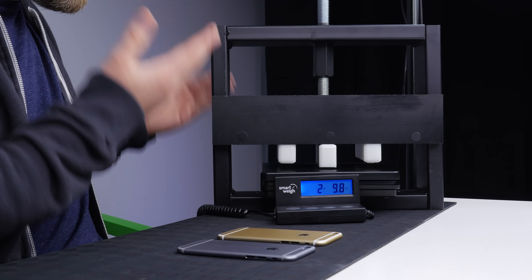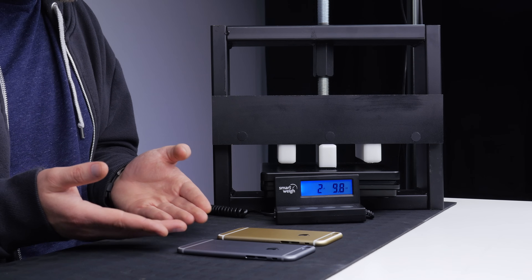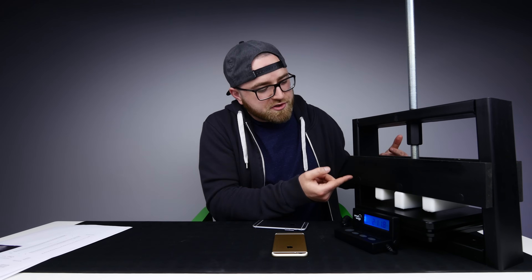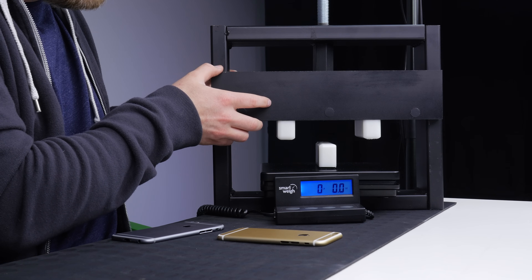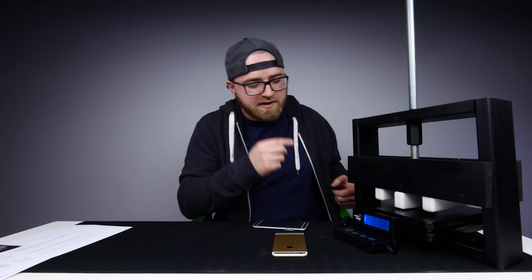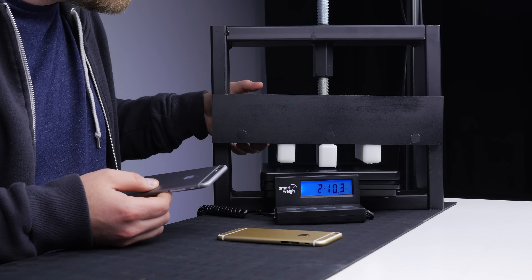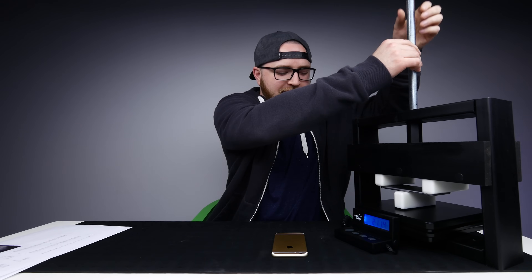But the real question here is how much stronger? Is it all worth it? So beside me, I have this crazy contraption which is going to measure force applied to each of these units, and I'm going to find out exactly how much stronger this component is as it is the backbone for the upcoming iPhone. Let's start with the iPhone 6 shell in order to get our baseline. The reason you're already seeing a reading on the scale here is because this top portion of our contraption is on top of the scale itself. If I lift this up, you'll see it comes down to zero pounds, zero ounces. So the moment I insert this shell, we're starting at a point of two pounds and about 10 ounces.